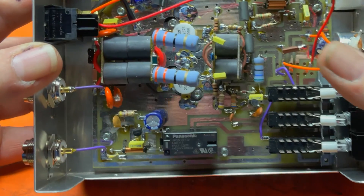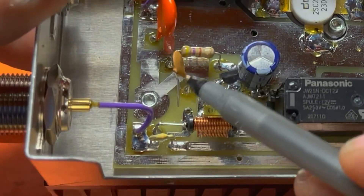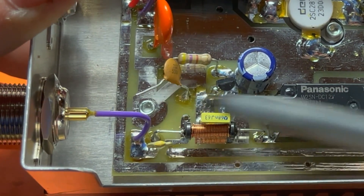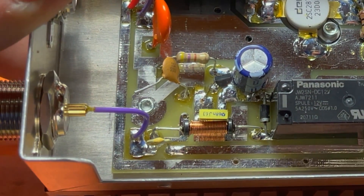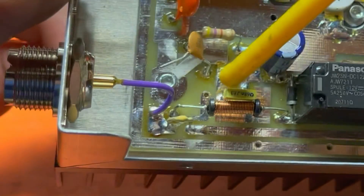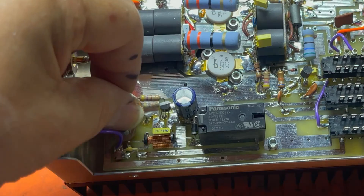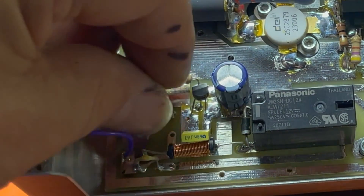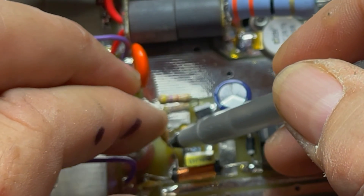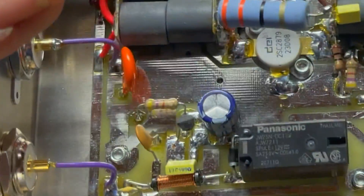There's the inside of it. What we're going in at right now is this little capacitor right here — see the leg not connected? We're going to connect it to that solder pad right down below it. Let that leg go down through the hole, but just barely through — if you push too hard, it's going to touch the bottom and short out. Then put some solder in that spot right there.